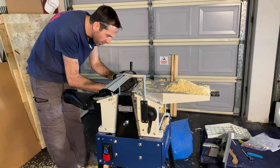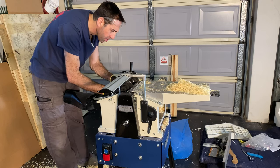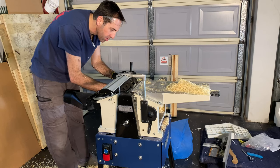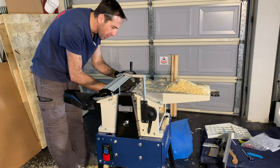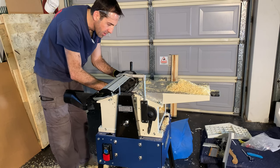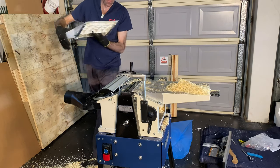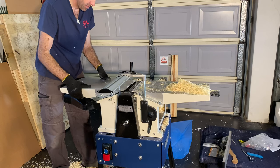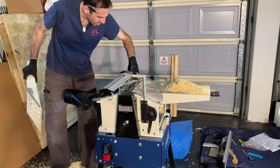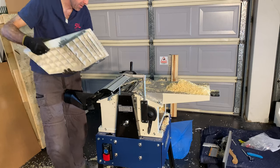And we'll put that back into joining mode. One of these blades must have a chip on it. Very minimal. And it does allow you to turn them eventually. You've got four sides to each blade. Okay. These are clear of any debris. Just like this.